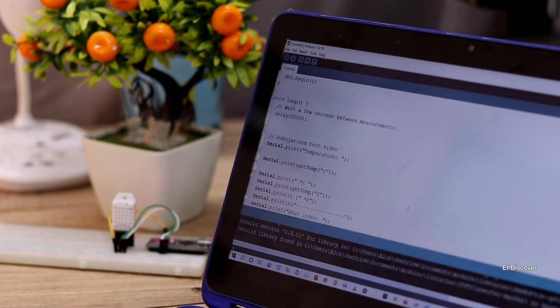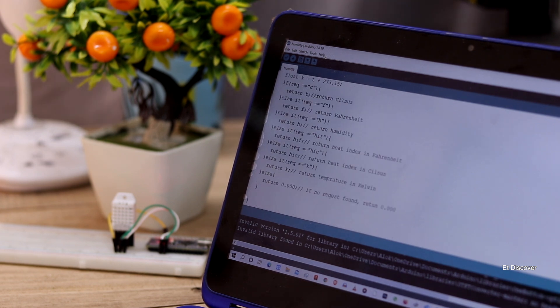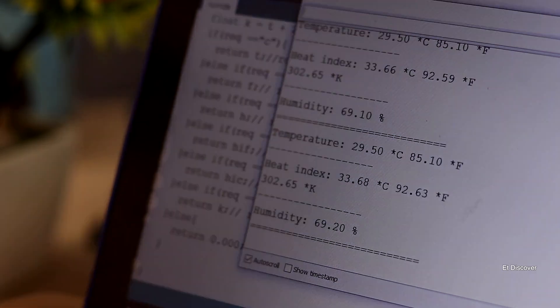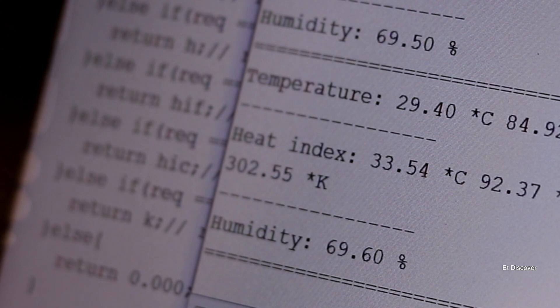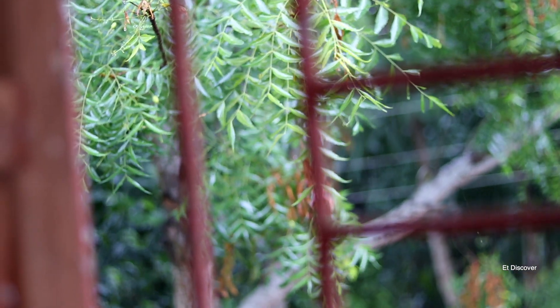On my laptop you can see this is the Adafruit library example code. Just upload it and open the serial monitor, and you can see the temperature and humidity values. We only need the humidity here, and right now it is showing approximately 70% because it is currently raining outside.